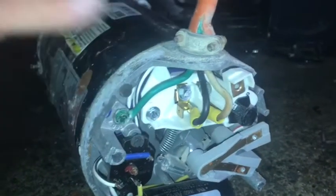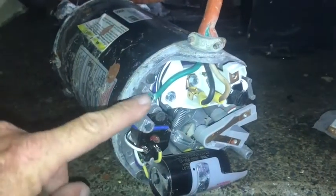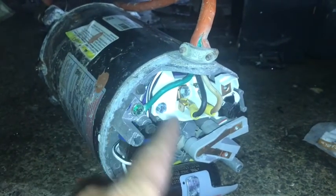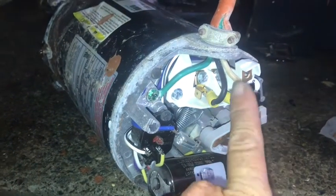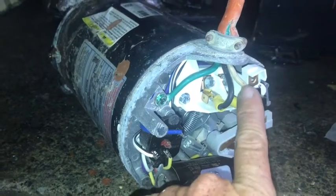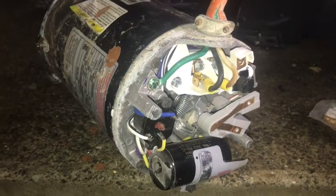What I'm looking at to remember for myself is that this is the top of the motor. We've got the ground wire connected here, next comes the black wire, and the white wire is right next to the switch — from 110 or 115 to 230. So I'll remember that the white wire goes right there next to that switch, and now I know I have my pump wired correctly. We already switched to 115.